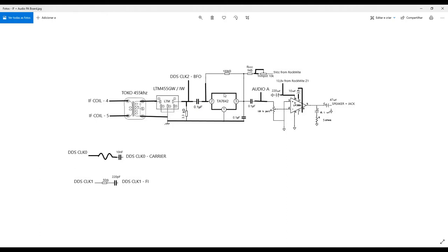And some amplifiers also for the radio frequency, for the receiving frequency here, okay? And this circuit comes with some feedback loop, okay? We have it here. It's important to have a trim pot here so you can make a fine adjustment on your feedback line here.